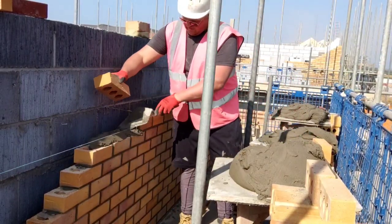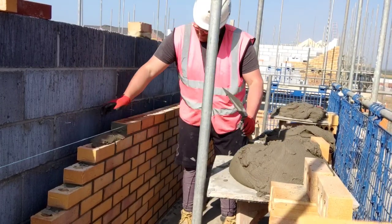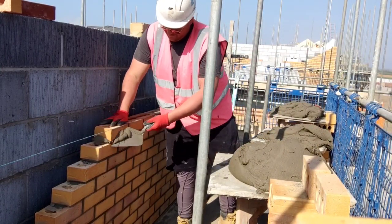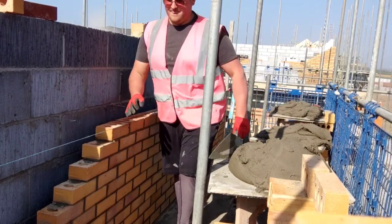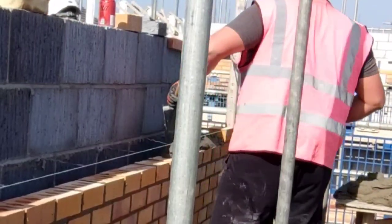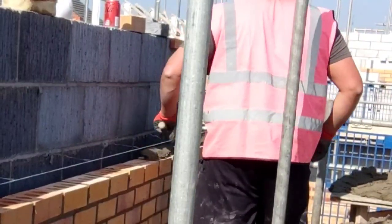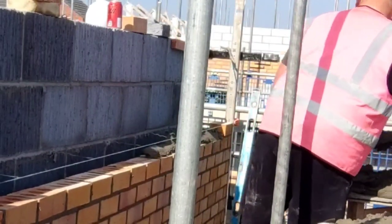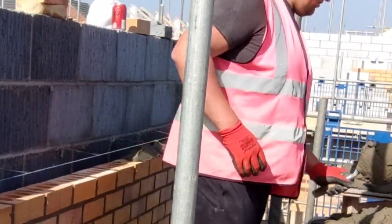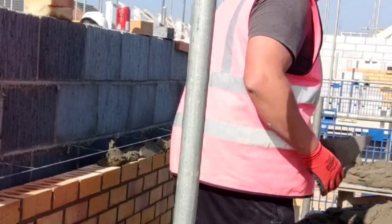instead of three. Whereas like the traditional big corners, you're sort of building on a square plot at least, building four big corners and then running in between each one of them, which works very well on a square plot. But this plot in particular has a porch on the front, so it's got two internals. So we're going to be running this plot still in four sort of runs, but it'll include an internal, and then it'll have five hits in a sense, because it'll have the front to run in that we'll leave down for access for doing the block until the very end when we have to fill it in.